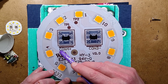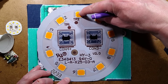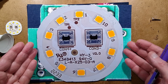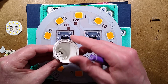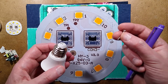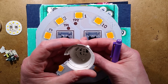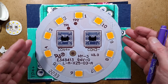The LED panel of the low-power warm-white lamp — this 3.4-watt one — has 10 LEDs. The LEDs are wired as parallel pairs, all wired in series, so there are effectively five parallel pairs in series. Each one has six chips per LED, giving roughly 18 volts per parallel pair. The circuitry is completely off-board. The housing is not aluminium like the other one; it's a thermally conductive plastic housing. The centre contact stud for the E27 holder goes right up the inside to the wire pinching point at the very end — quite unusual, possibly to make it universally suitable for different lamp holders.